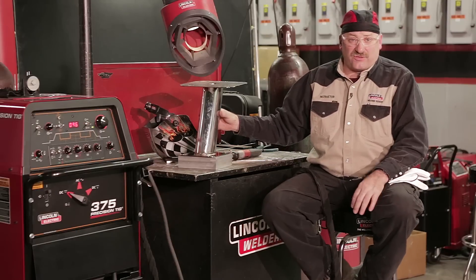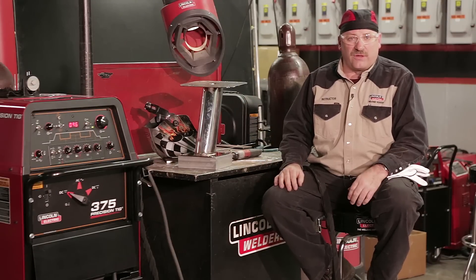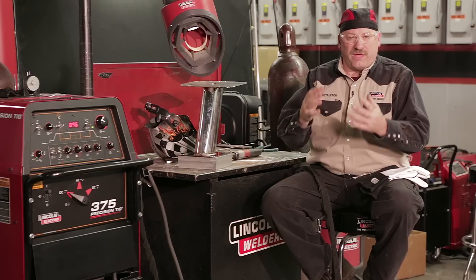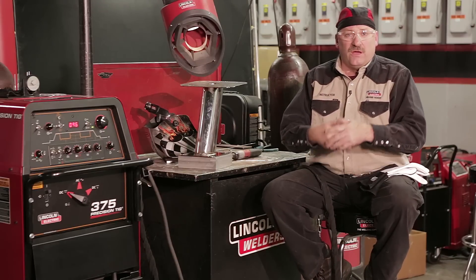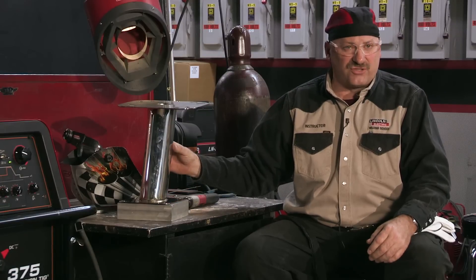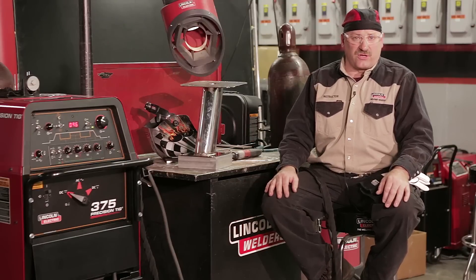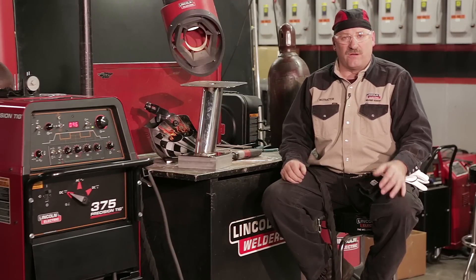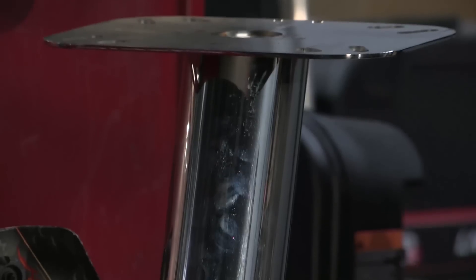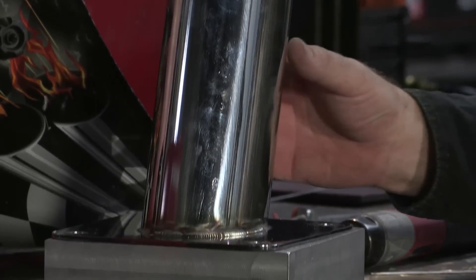As you know, there are a lot of different kinds of stainless. This is an austenitic stainless — a non-magnetic stainless. The base grades have about 18% chrome and 8% nickel, but they vary the chrome and nickel content depending on service conditions. This is 316L stainless, which has a little more nickel and also has molybdenum added. Anytime you're within five miles of the coast, they recommend 316L stainless because of pitting corrosion. It's also used in many industrial applications where chlorine is present, such as swimming pools.